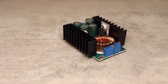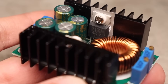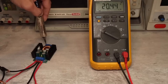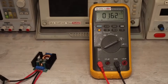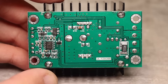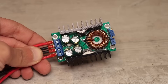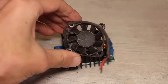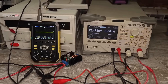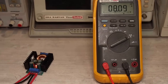For high-power applications, here is a step-down voltage and current stabilizer based on the XL4016 chip. The input voltage range is from 5 to 40 volts and the output is from 1.2 to 35 volts with adjustable current from 100 milliamps to 8 amperes. In theory the efficiency can exceed 90%, and the 300-watt power rating is sufficient for building powerful charging devices and powering high-power LED matrices. However, if you plan to draw more than 100 watts you need to attach a fan. Many people use this as a basis for laboratory power supplies, but it's not the best solution because the output voltage ripple and adjustments not starting from zero make it far from ideal for a lab power supply.